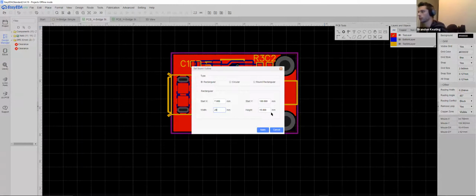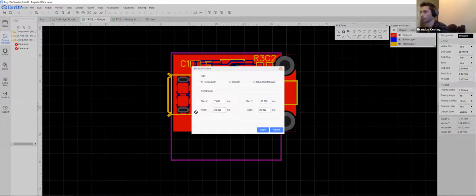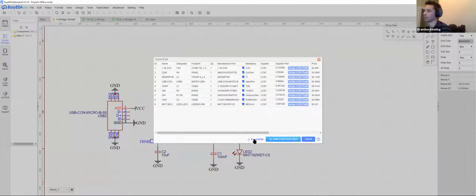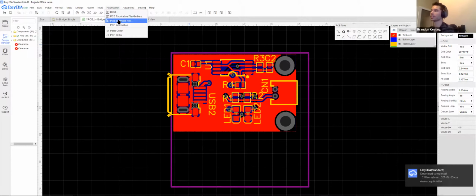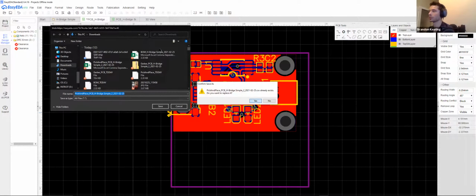They need 20 by 20 in order to assemble it, or 20 by 23, then I guess we'll do. Yeah, sure, 25 by 25. So this will look a little funnier, but whatever, it'll work. That does mean re-downloading the BOM though. And re-downloading the pick and place. But believe it or not, this is so much less of a pain to order through these guys than to go through somewhere else.